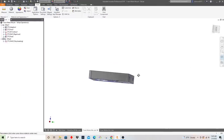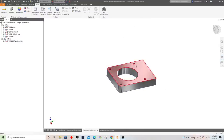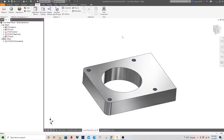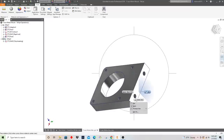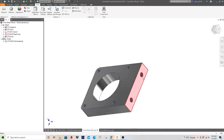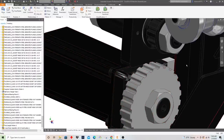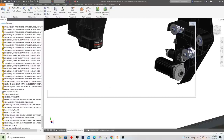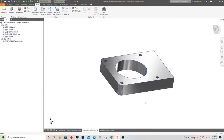It's pretty simple. It's an aluminum bracket, half inch thick. It's got four tapped holes for 10-24 screws. Those are what mount the stepper motor to this bracket. It has this bore here, which is a spigot fit for the stepper motor for alignment. And then here we've got two quarter-20 tapped holes, and that bolts the motor mount into the upright here. So pretty simple part.